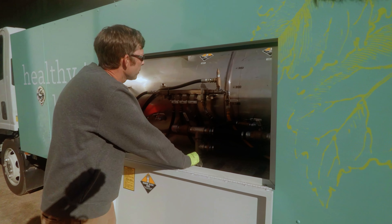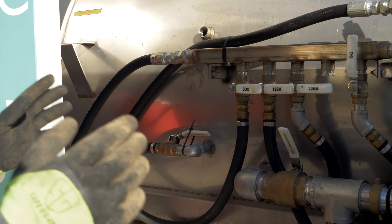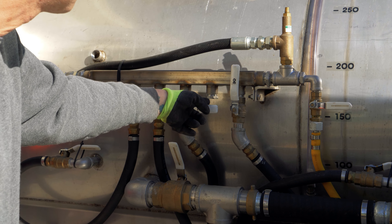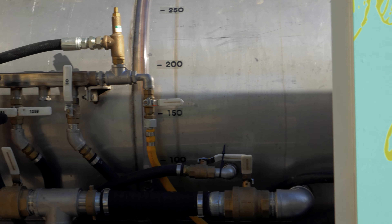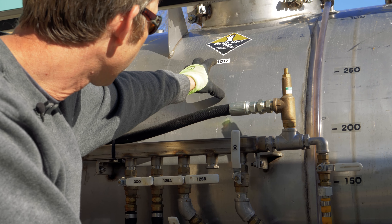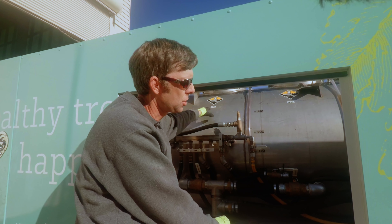Just to simplify it: there are a lot of ball valves, but for each tank there's only a set — meaning two ball valves per tank. They're all numbered and in line with the way the tank is set up: 300, 125A, 125B, and 30. As long as you know the large one is 'from' and the small one is 'to,' and both valves for the tank you want are in the open position, you shouldn't have any problem.